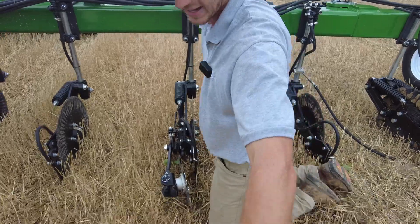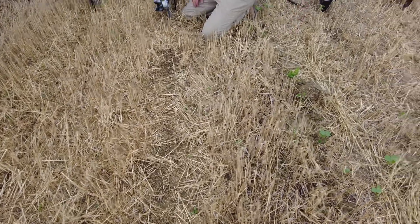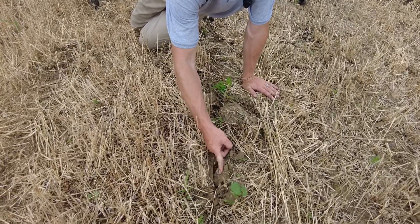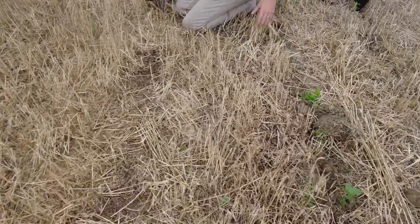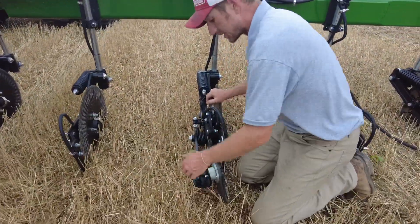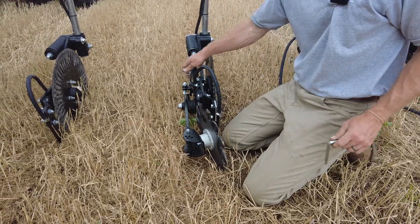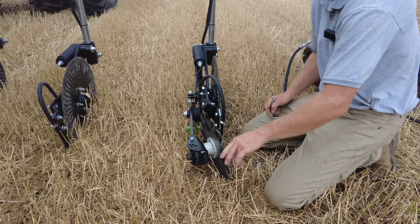Now we were talking about sealing. If you back up, you can see the absence of a seal — we've got a line going down through the ground. What's going to happen is this line is going to begin to open up as that sun shines down and dries it out. That'll expose the fertilizer you put right down there. That's where this Yetter innkeeper comes into play. We can adjust this innkeeper from side to side on how aggressive we want to run it, and we can adjust our spring tension on it to really get a good seal. We're going to place our fertilizer deep and then seal it with the Yetter innkeeper.